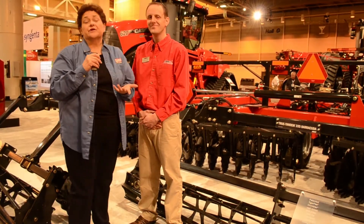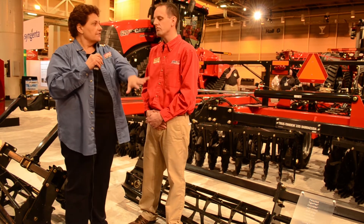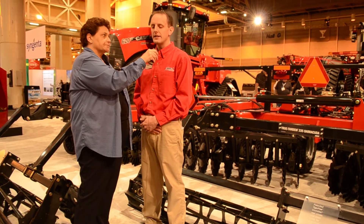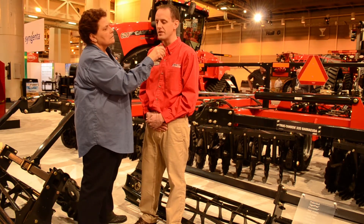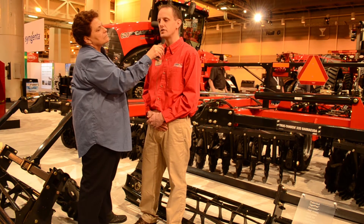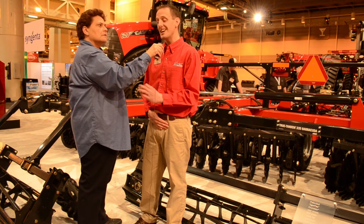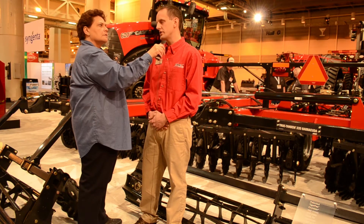So Chris Lurson is along with us here on the trade show floor at Commodity Classic. Visually describe for me what the ground looks like behind the last of the Tiger Paws. The surface finish is a critical thing — many customers are judging that book by its cover. You're looking at 95 to 100 percent residue cover when combining heavy 150 to 200 bushel corn. We think we can knock that down into the 70s, whereas vertical tillage is often in the 80s and 90s as far as percent cover. So we can get ourselves down there and give a blacker surface finish, while keeping high productivity levels.